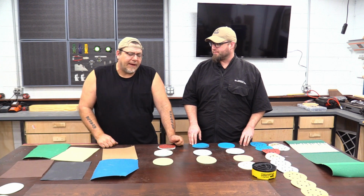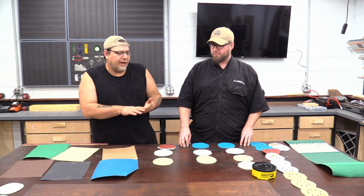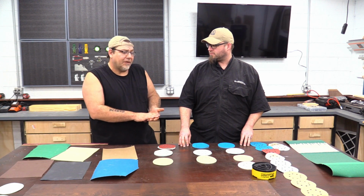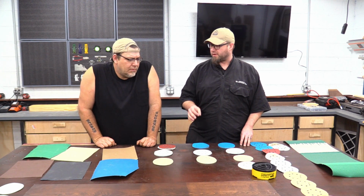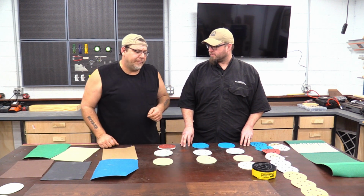All right. And I like the stain demonstration because that shows, especially those high raised areas of the grain, that if the stain's not getting through, the oils and other things are definitely not penetrating, so there's no mechanical bond there whatsoever. Correct. And a lot of times that's where your peeling starts to happen. Chipping and peeling normally happen where it's already burnished.